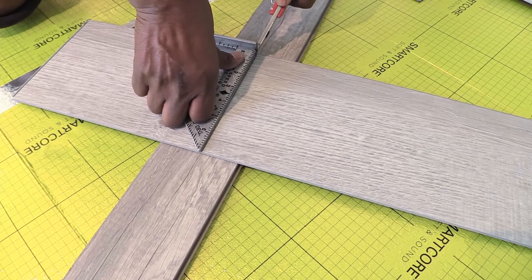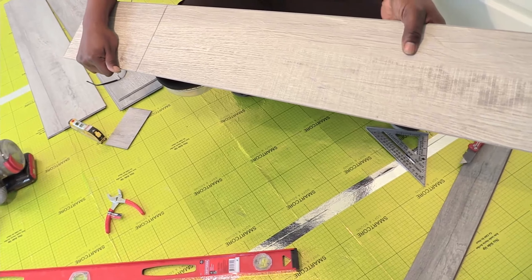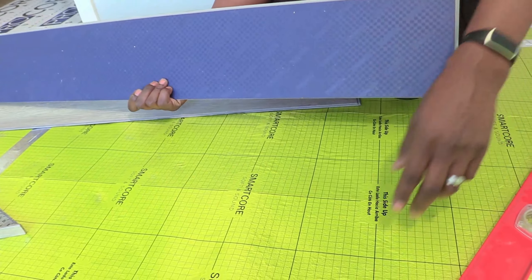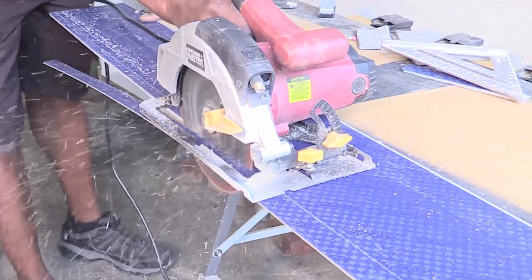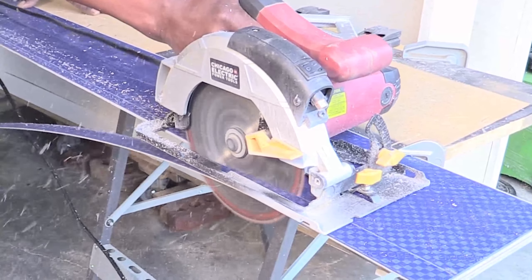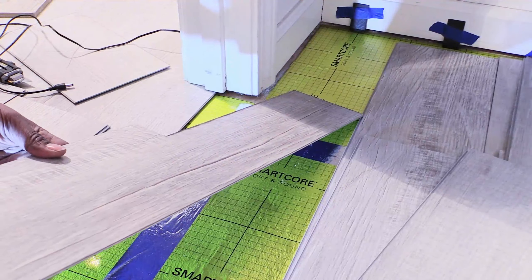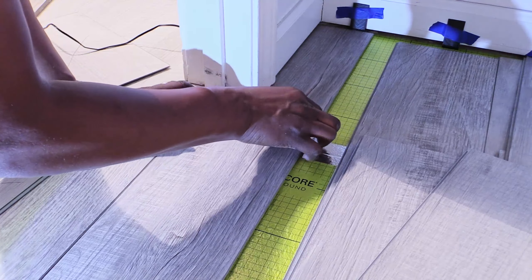One difference is that vinyl planks can be scored and cut on the ends with a box cutter or utility knife. Luxury vinyl planks have more synthetic layers and come with an attached pad — we found it more effective to mark and cut them on the pad side to avoid chipping the top surface of the plank. A circular saw can be used for lengthwise and special cuts. For vinyl planks without an under pad, we cut on top. Special cuts allowed us to form fit the planks around door casings, closets, and entryways for a nice clean look.